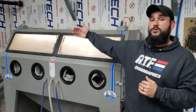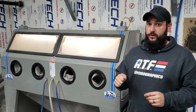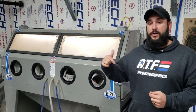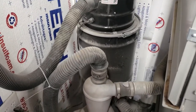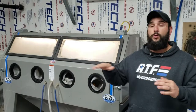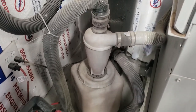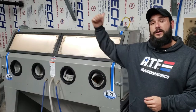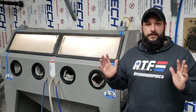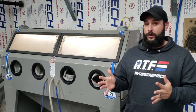Because this thing is so wide it has two stations and two windows, so you can use it from either side to get to both ends of a really long part. It's foot pedal operated, which is a lot more comfortable than squeezing a trigger all the time. It has two LED lights on the inside to keep it nice and bright, and a two-stage filtration system. Air comes out of the sandblaster into a cone that vortex-spins it, dropping the big particles down into the bottom and leaving less media in the airstream before it goes into the final vacuuming system — the big black unit in the back — which has an actual air filter and pumps air from inside the dust separator to the outside of the building. The media I use is aluminum oxide or red garnet, 100 or 120 mesh.